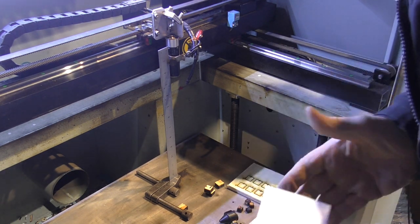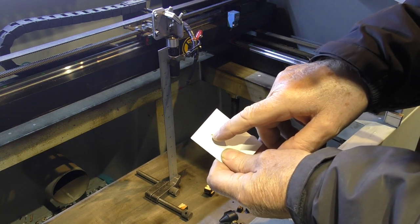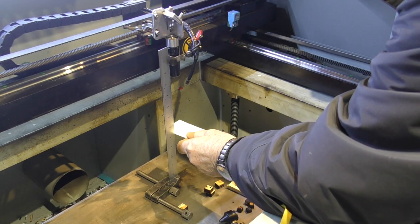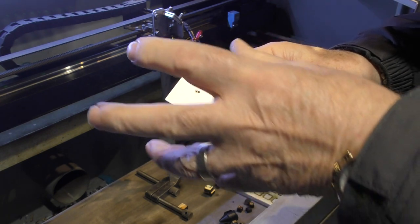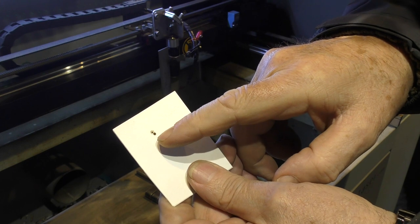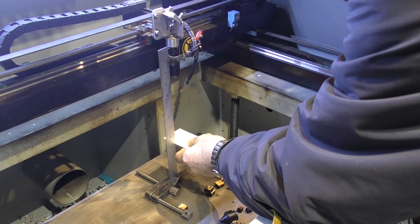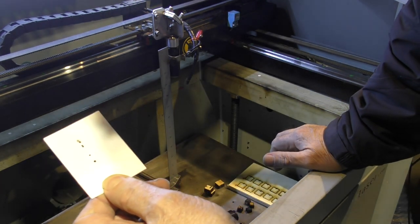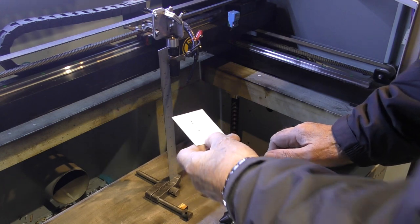The idea of the focal distance is that all the rays pass through a spot size at that point. That looks like a three millimeter spot size, so something a bit strange is going on. At eight inches the hole is slightly smaller, but now the burn around the outside is actually more compact. At eight and a half inches the hole and the burn are nearly the same size. At nine inches it's much the same as about eight and a half. At ten inches we're getting bigger again, so the focal distance is somewhere between eight and ten — it looks as though nine might be it.